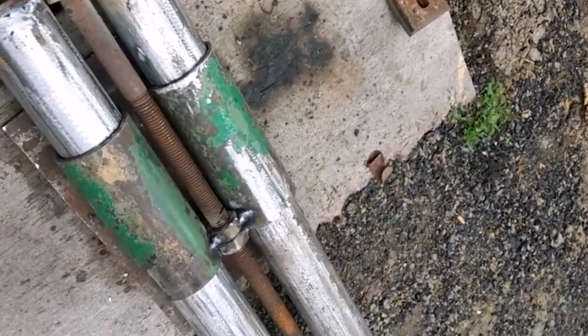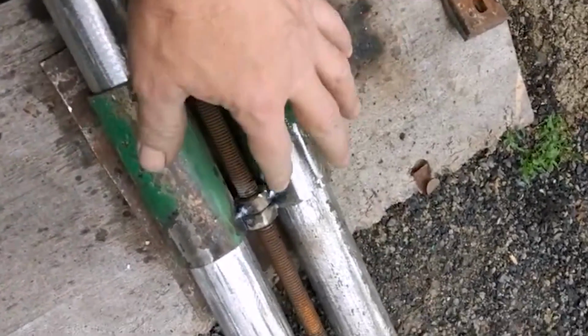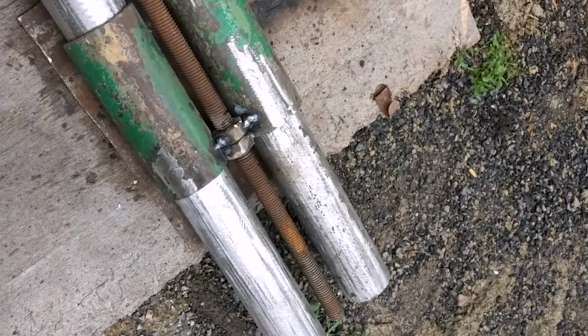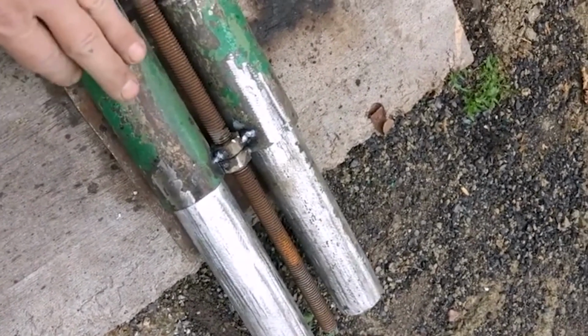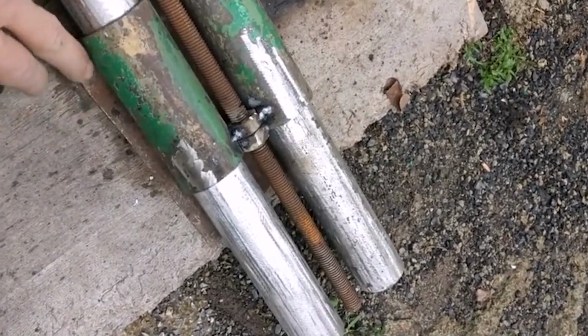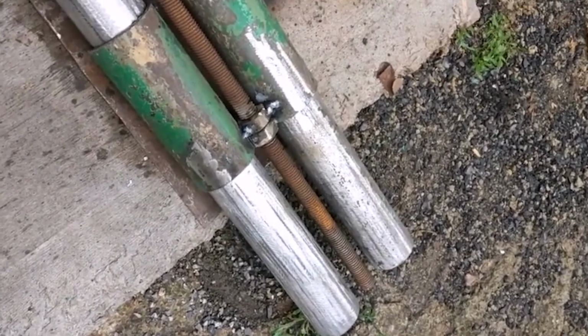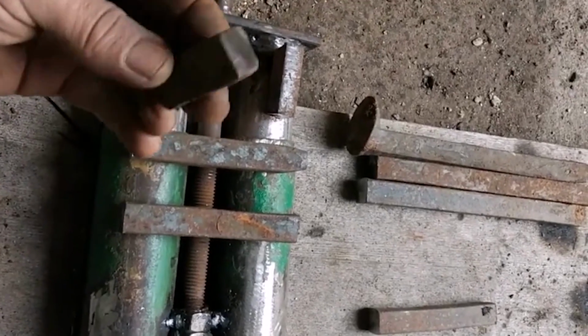Create 2 identical pieces from the provided material, resembling 2 pipes that hold an angle iron between them. Leave enough space between the pipes for interaction with the vise. Then glue neodymium magnets using superglue and baking soda into each piece. These magnets are essential for a strong grip on the vise jaws.